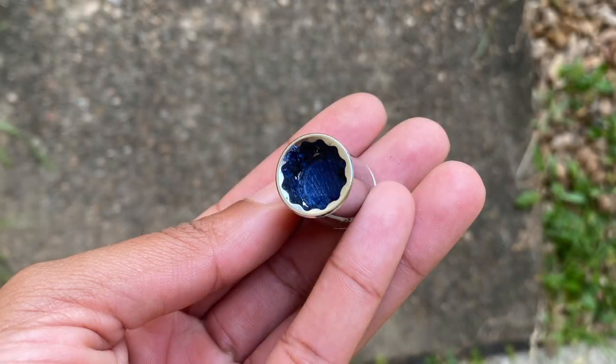While installing some of the bolts using a socket, I noticed that it was stripping away some of the paint coated on the bolt. So using a piece of tape from previous sections of this barn door series, I coated the inside of my socket. Here's a view of what that looked like.